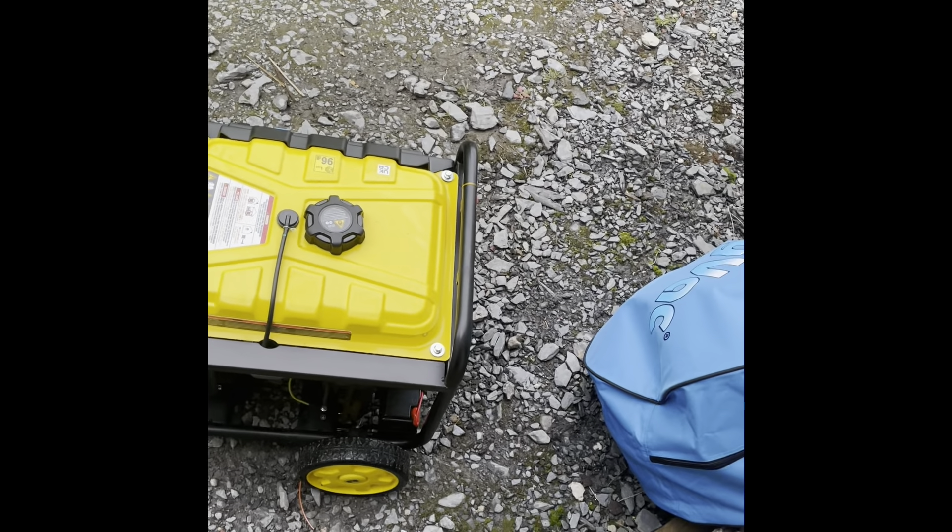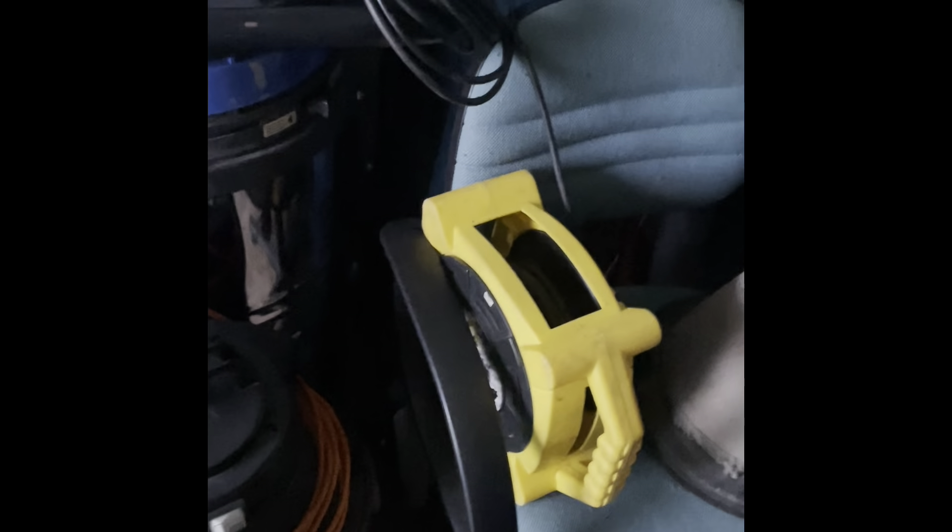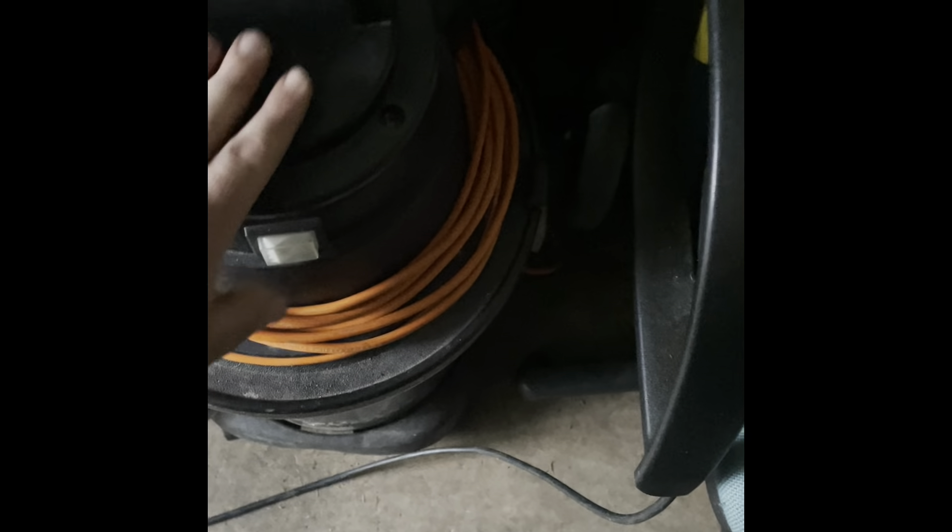When you're using the generator, don't fire all three motors on at the same time — even when plugged into mains. Do each one with a little bit of time to ramp up. We're not talking minutes, just five seconds or so between each. As you can hear it does pick up the revs considerably — it is noisy. But it's case-by-case: if I'm working next to an old folks' home I'll ask for mains power; if I'm in an industrial unit I'll use the generator.